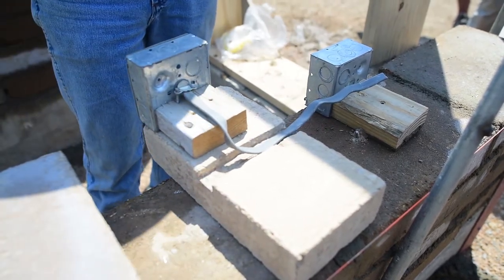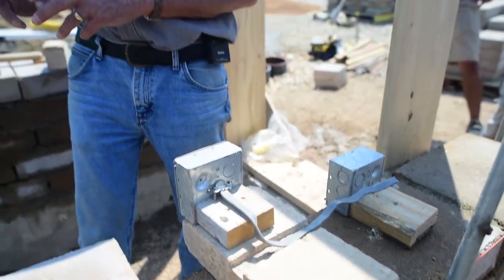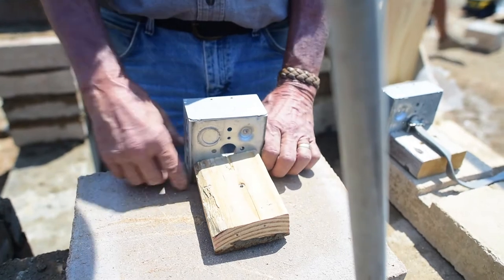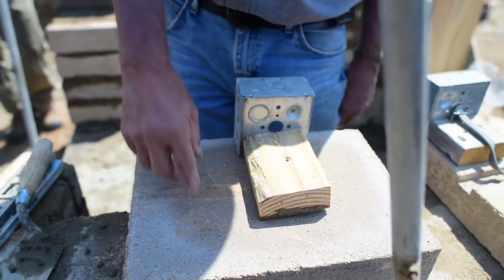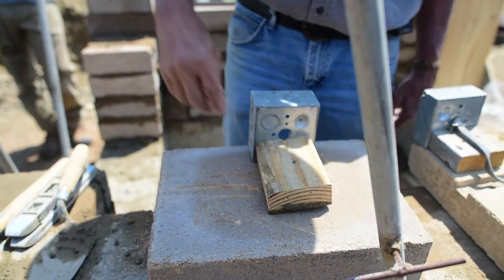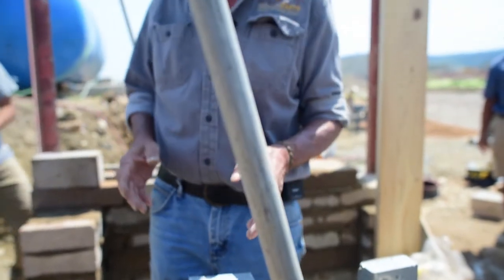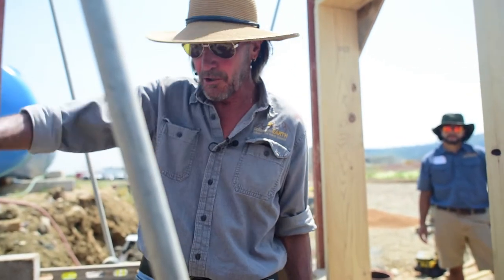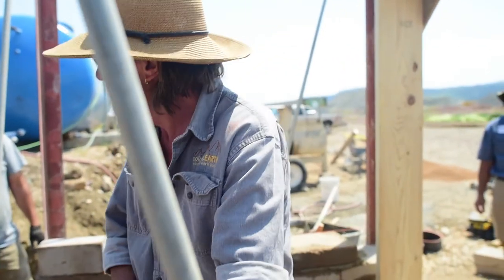In some jurisdictions they require you to use conduit — EMT, the metal tubing. With the metal tubing, the sweep is bigger coming out of the back — it's three-quarters of an inch thick. So what we do with conduit: we wouldn't do the little trench. We would bring the conduit out, set it on top of this row with some little clamps, screw it down, and around it goes to the next box or up the door buck for the light switch. Then there's a guy on the brick saw cutting a bunch of blocks that have a one-inch deep trench in them across this way, and that just sets over the conduit.